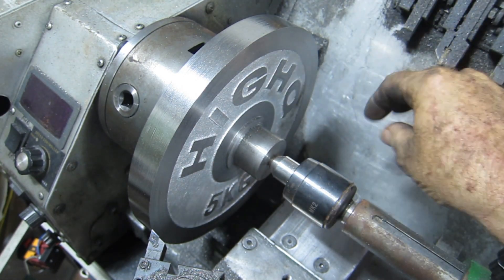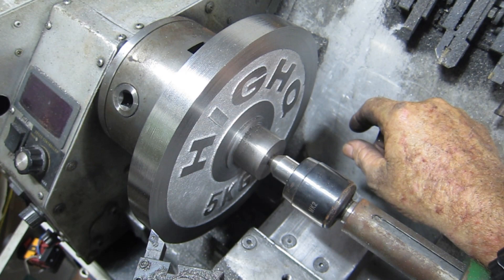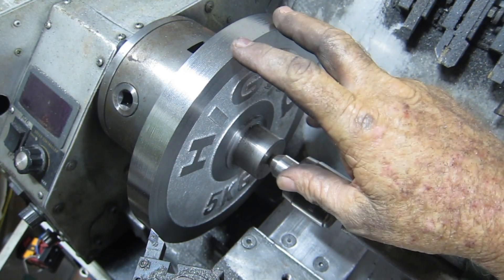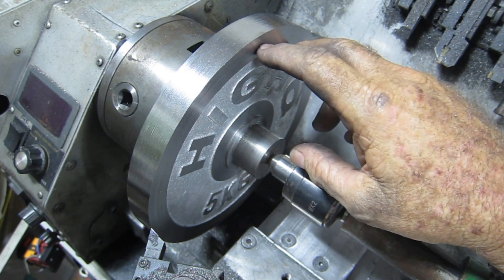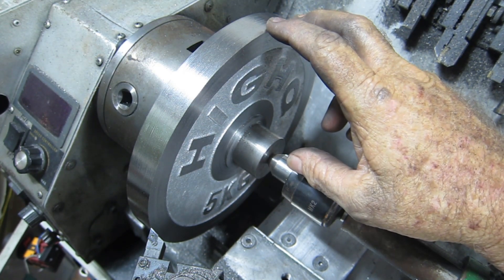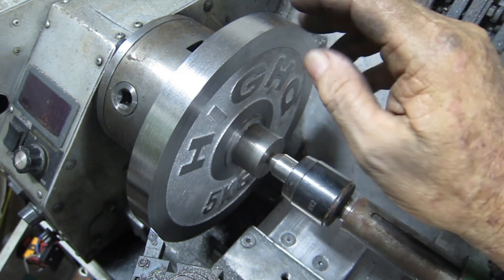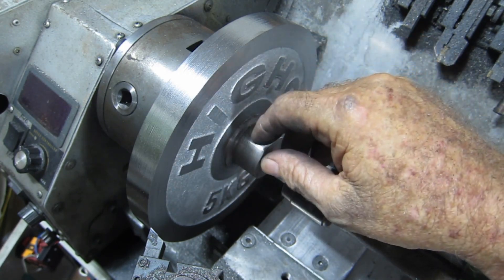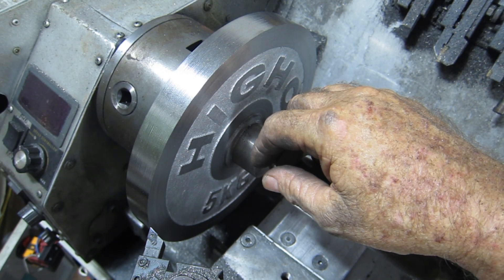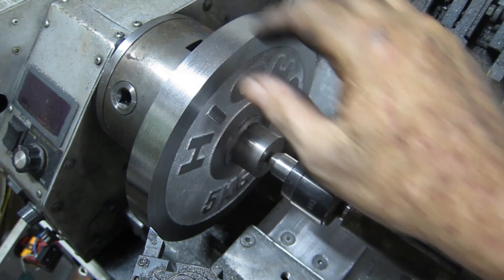I got nothing done yesterday — I woke up feeling like death warmed up. My wife's been battling the flu and my Aussie mate's daughter whose birthday party we went to on Saturday has got COVID. I started to wonder if I had flu or COVID but turns out I was being stupid machining this stuff without a mask — I was breathing in all the cast iron dust. It's now Wednesday. I've also sorted the overheating — it's not the motor, it's the little circuit board and Chinese speed control. With these new tips I can take 0.2 to 0.25mm cuts, get two passes, then flip the cabinet open and hit the board with compressed air to cool it quickly.